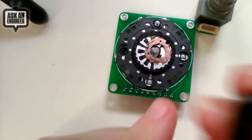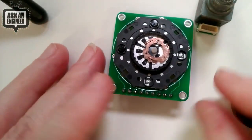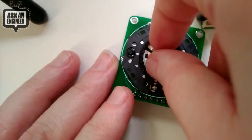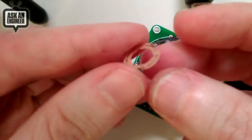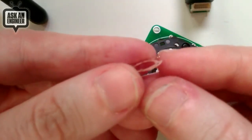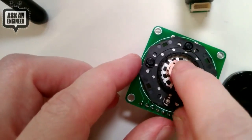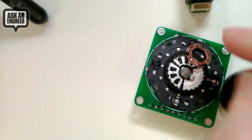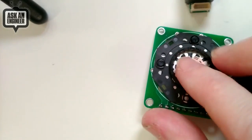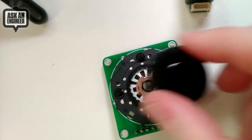This is a click wheel breakout that we have — it rotates and clicks around, and I removed it so you could see what's going on. Inside, there's a little leaf spring contact, and you can see it's got these little bendy parts that come down. As this rotates, there's a little pattern cut into the bottom contacts, and as it rotates it connects and disconnects. That connection-disconnection is how it can count the rotations.